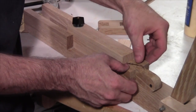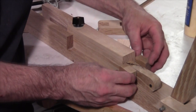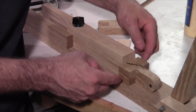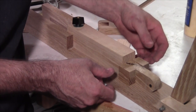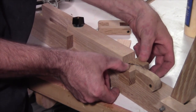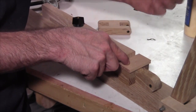After a little fine-tuning, I've got just the right height — just a fingernail grab above this plunger. Let's get the plunger in the center of our tailpiece. Take our two blocks and get them squared up and up against the side, and you want everything touching that tailpiece. That's where we want to glue and screw these two pieces. If you don't want to screw them, you don't need to — they're just guides. You can glue and then just put a couple of clamps on the side until that glue sets up. Then we're going to take our little cap piece — it'll be flush up against this as well — and put a couple of pin nails in there just to hold it in place. That just keeps the plunger from wanting to lift.